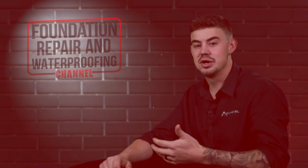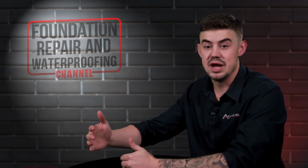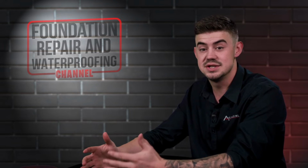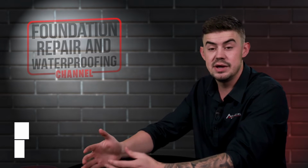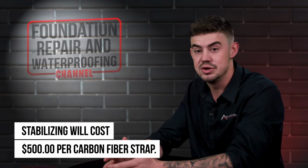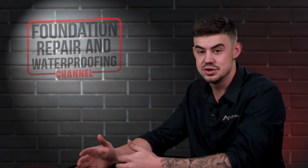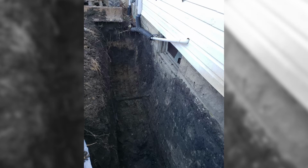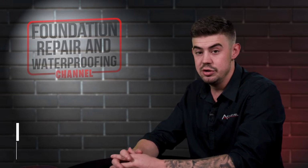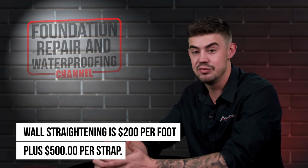When you think about the cost of fixing a foundation that's sheared, it really depends on how much it's sheared. Like we talked about earlier, can it just be stabilized, or does it have to be completely straightened? If it can just be stabilized, you're going to be in the realm of about $500 per strap. We space those straps out every 4 feet, so that's going to be on the lower end. Now when you get into straightening that wall to solve this shearing, you could be about $200 a foot plus the $500 per strap every 4 feet.